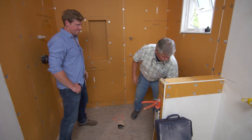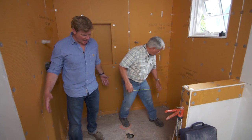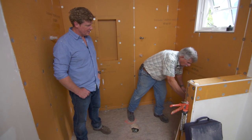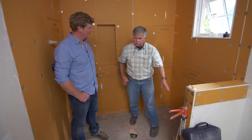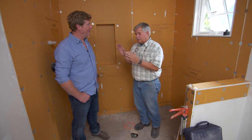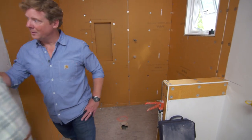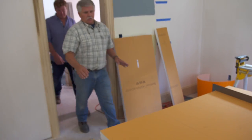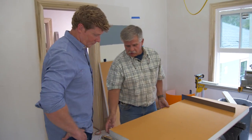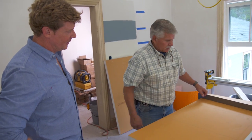The next thing we're going to do is build a bench right here in the big shower — a place for them to sit. We're building it all out of foam. You can build it out of wood, but the foam offers great stability. We're going to support the top of the bench with two-inch foam board — that's going to be the legs. We've already cut the back part, so now I'm going to score the front and snap it.